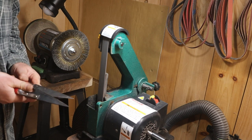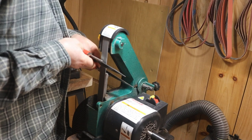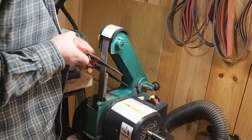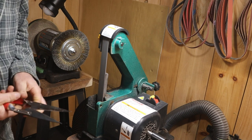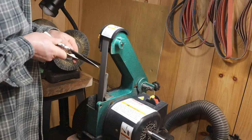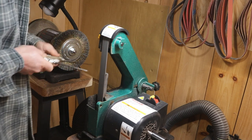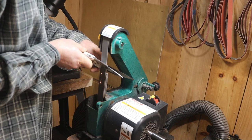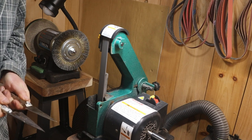That makes the nick go away. I'm really looking for it now, so I do another pass on the finer belt to make sure we get it — a pass on the belt, then close the blades together to cut that burr off. Those are smooth. For these scissors, I've gone through many iterations including polishing, but in this instance I'm finishing at 400 grit and then deburring with leather.